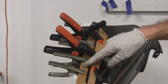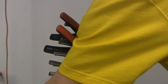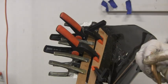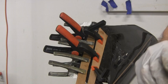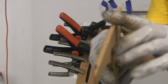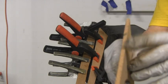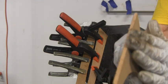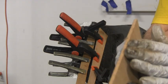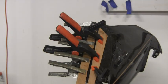Normally when I'm building boats I always caution people to round over the edge — never have a sharp edge, because the glass will never set on it. It'll be flat on one side and raised on the other. Just put a slight radius in it, like an eighth of an inch radius, and then the glass will settle on it. So we'll come back tomorrow — you have to make sure it's secure.